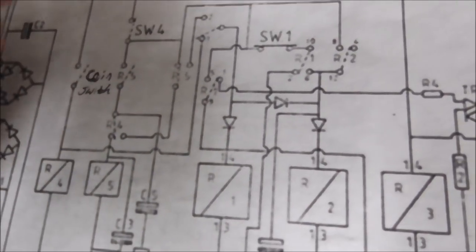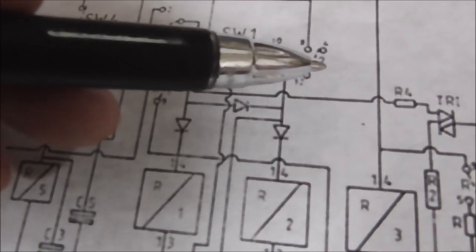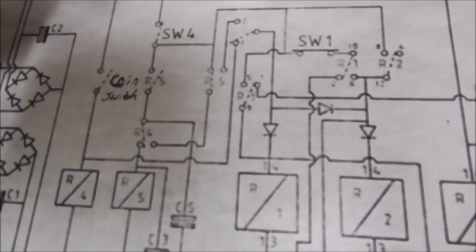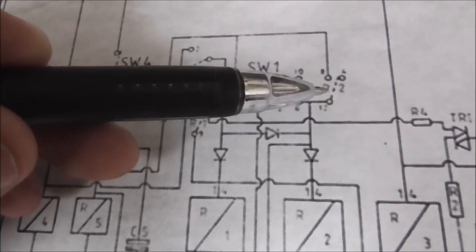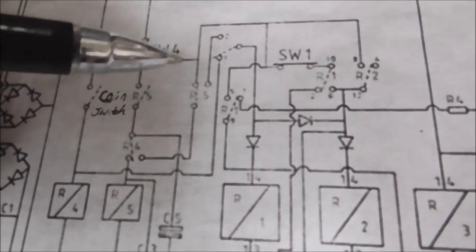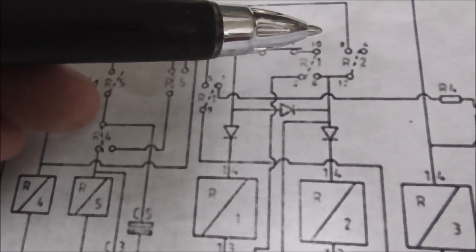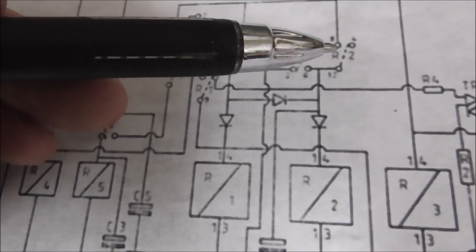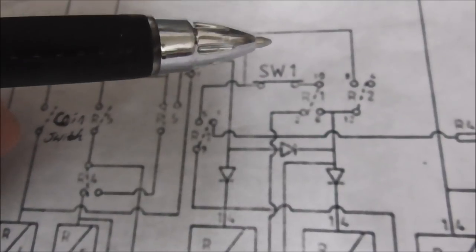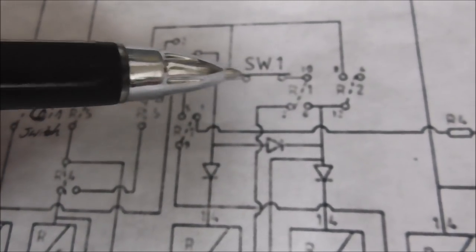Maybe. We'll see if they've wired anything in. But whenever I hit that, it's going to do some stuff over here. When this switch closes, it makes a motor move, blah, blah, blah. We'll get to that in a minute. So when I hit it, it will turn on this switch. So if this switch were to turn on, I don't know why they need that. Oh, I guess if switch 1 opens, relay 1 no longer has a way of getting power.